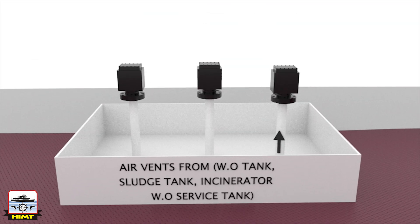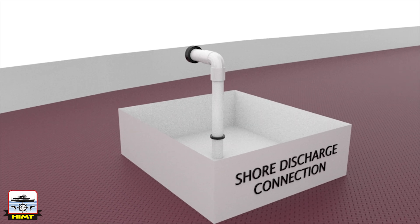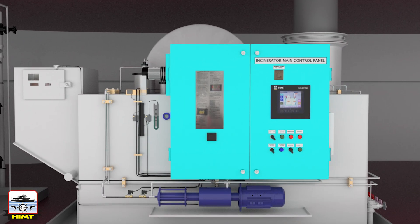All tanks have a vent head at the upper deck. It is through these vent lines that the pressure inside the tanks is maintained at atmospheric condition. As a safety precaution, all vent heads are fitted with a flame trap inside. If the ship has to discharge its waste oil to a shore reception facility, it can be done with the help of the shore discharge connection. Pumping is carried out using the sludge pump, and an emergency stop button for the sludge pump is provided nearby at the upper deck. A sludge discharge checklist has to be filled up accordingly. Next we will look at the procedure for the preparation of waste oil.